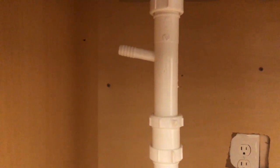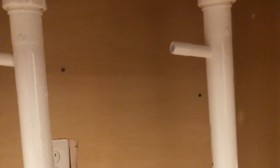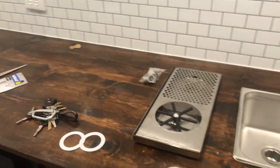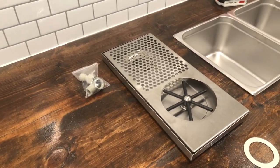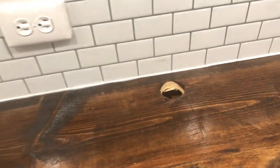This is the trap, and then we have these little spouts coming off where the rinser will hook up, the ice bin, and the espresso machine. I thought the coffee machine had one too, but as I was doing this I figured out it does not need one — but I'll have it there for future use and just plug it up. Next I'll take those apart, put the compound and adhesive on to make it all good with no leaks, and then run my drain hoses from the rinser and the espresso machine through that hole.